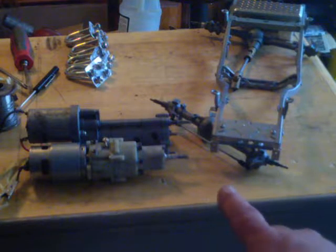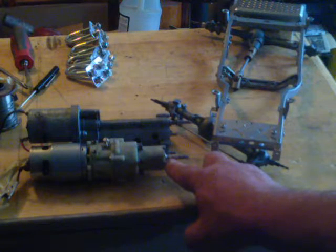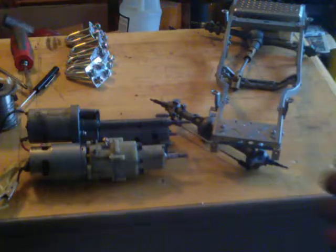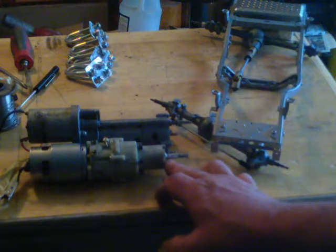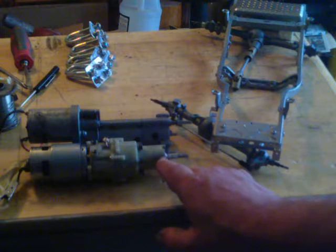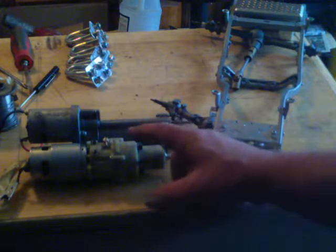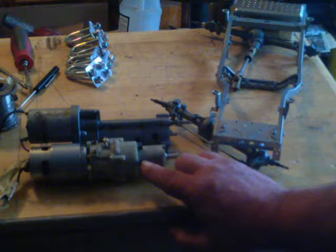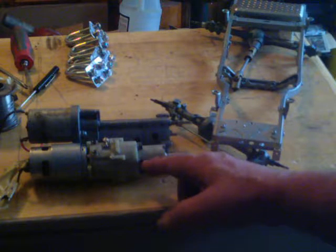It's exactly the same size — actually a little shorter, which gives me room on the back here to make a transfer case. Or I can just cut my shaft down; I left it long for a reason. I tore the chuck off — I actually cut it off because I just needed a little bit of shaft. This here is a bearing shaft coming into a planetary gear drive that has a high and a low range. Your slipper clutch — when you tear it apart all the pins and bearings and bushings are going to fall out, just throw them away.